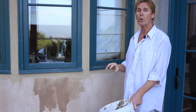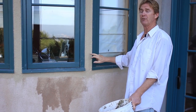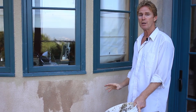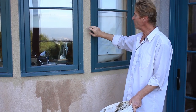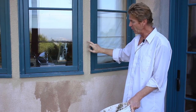It won't dry real weird where you see the patches like this. And lastly, you could fix it with an acrylic finish. We pressure wash it, apply primer instead of a bonding agent, and then use an acrylic finish over the entire area. That will be like a painted surface — it won't darken when it rains. So there are a lot of ways to do that.